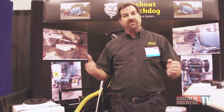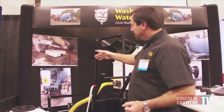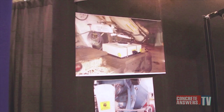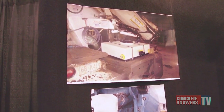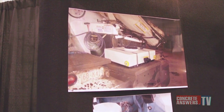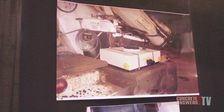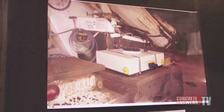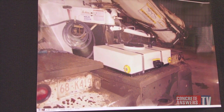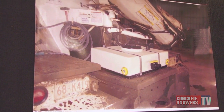We have a number of different types of tanks for different kinds of trucks. The top picture here is called a platform tank — they don't have any room behind their fenders, but they have room on top. This flat tank sits there. This one happens to be on Lafarge up in Fort McMurray, Canada, and it's insulated so the water doesn't freeze. You can see the 90-degree fitting on top, the valve, and plugs that allow any sediment built up in there to be cleared out.